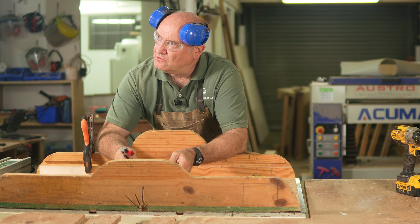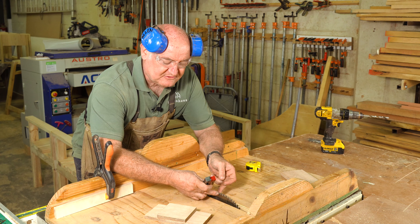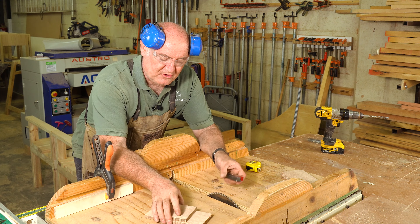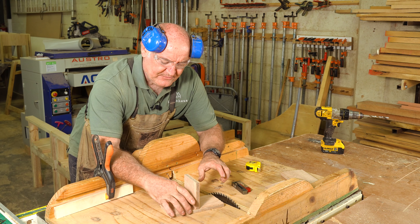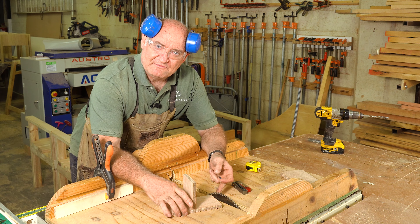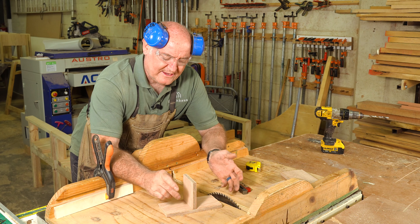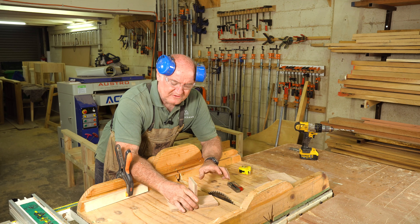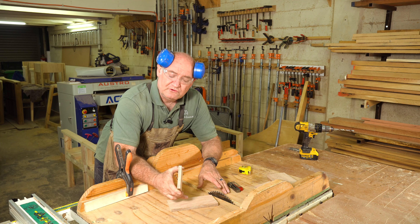If we put the kicker at a certain place we can hold it and test it — that seems about right. So that means I can say: if I put that in there, let's call that 50 mils — 5 centimeters or 2 inches for those who insist on imperial — and we're going to cut a groove that this component fits into. Not easy to do when you're just eyeballing it. I want to show you a cool little tool called a kerf maker, which will help us cut the exact kerf for this piece to fit perfectly, so we can just use glue without needing other fasteners.